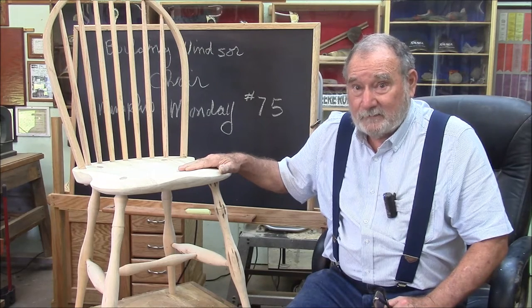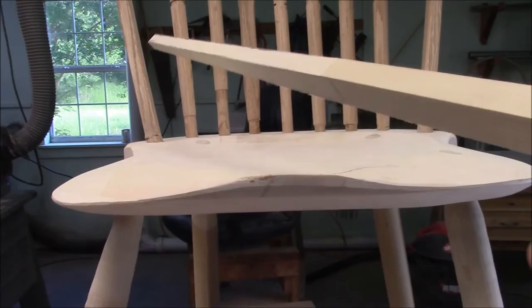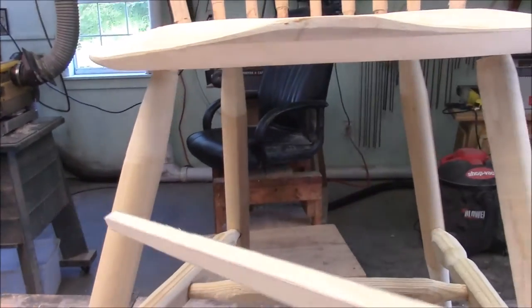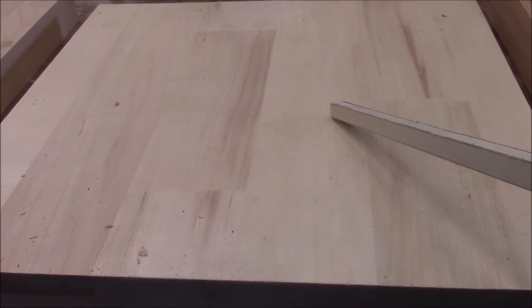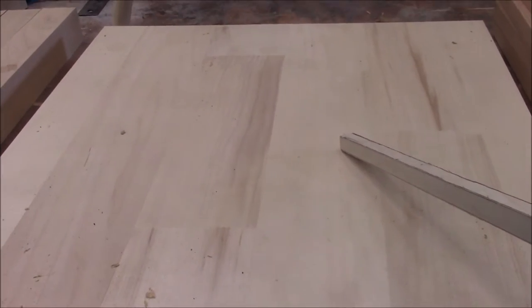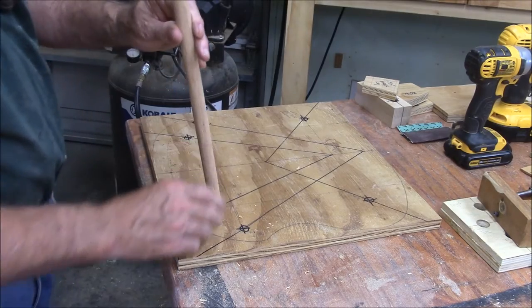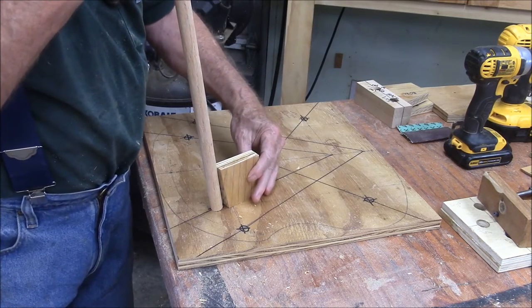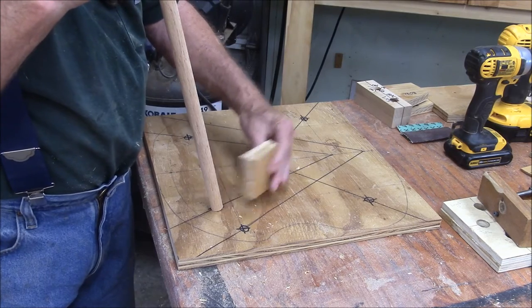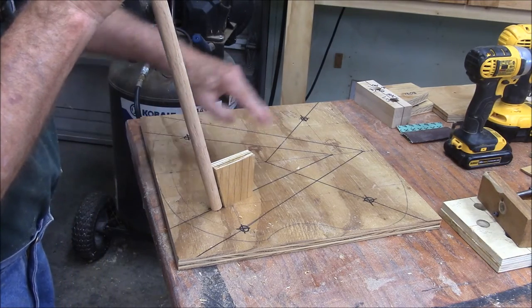Let's go over that prototype and take a look at it. The heart of the chair - if you don't get this right, nothing else will work, because the back is connected to it and the legs are connected to it. Here's the stock for the seat. First thing we're going to do is drill the holes in the seat that will receive the legs. We want the legs to splay out at that angle right there, so all we've got to do is figure out what that angle is. It turns out it's 14.5 degrees.